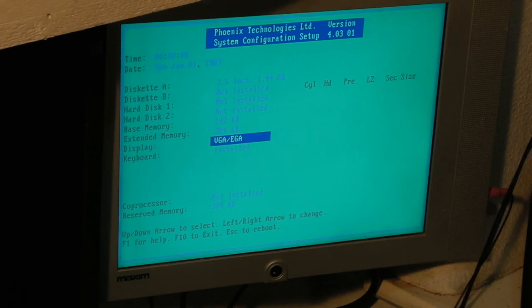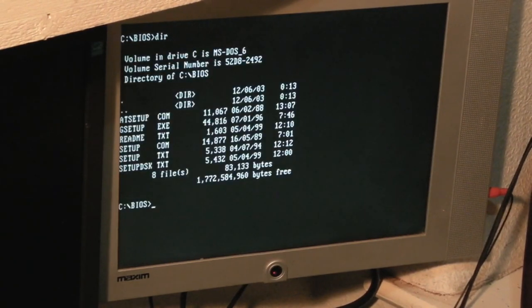What we need to do is press F10 now - that'll quit us out of this, back to BIOS. Interestingly, we can try G-setup and it should have actually retained the settings we just set up using setup. Because basically all three programs do exactly the same thing and they all seem to work quite fine with the Apricot hardware. So let's just go for G-setup.